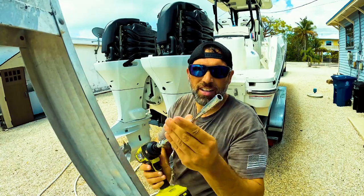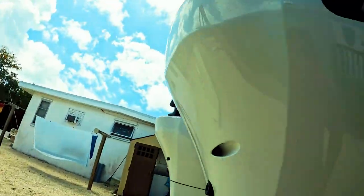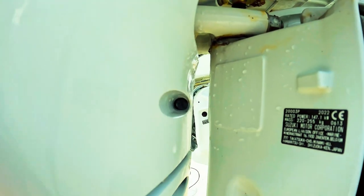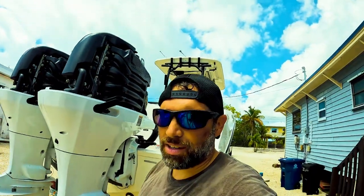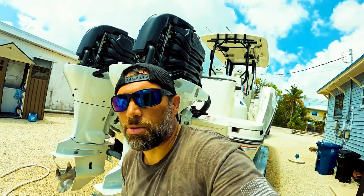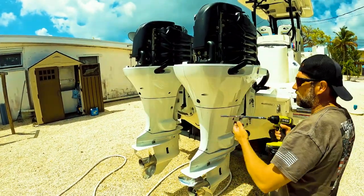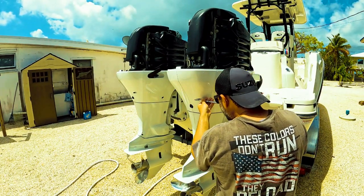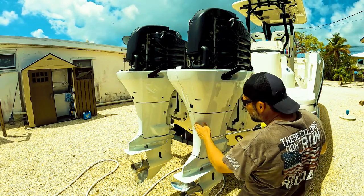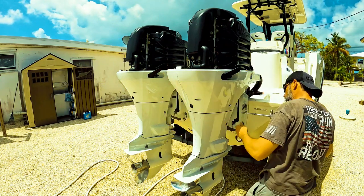This is an eight-millimeter. You can use a Phillips head on those screws in there, but you have the threat of stripping them out — I'm not a fan of that on a brand new motor and boat. So I'm going to use an eight-millimeter socket with a long extension to reach past these recesses. The screws stay in there — they've got a little recess. Very nice.